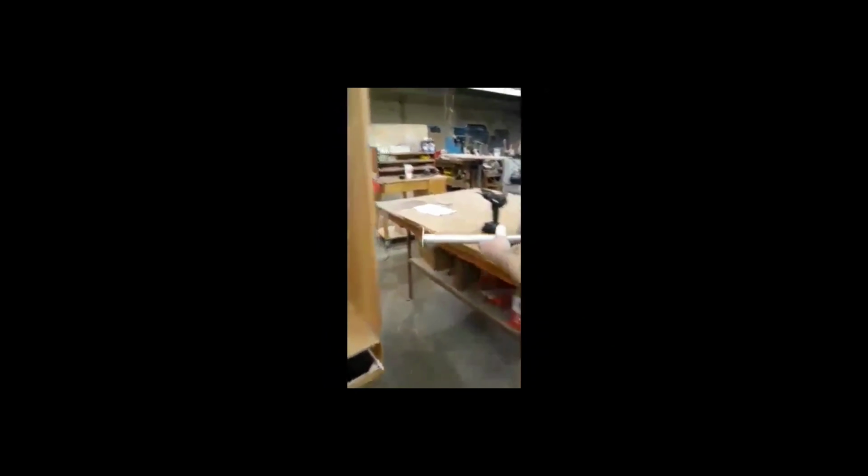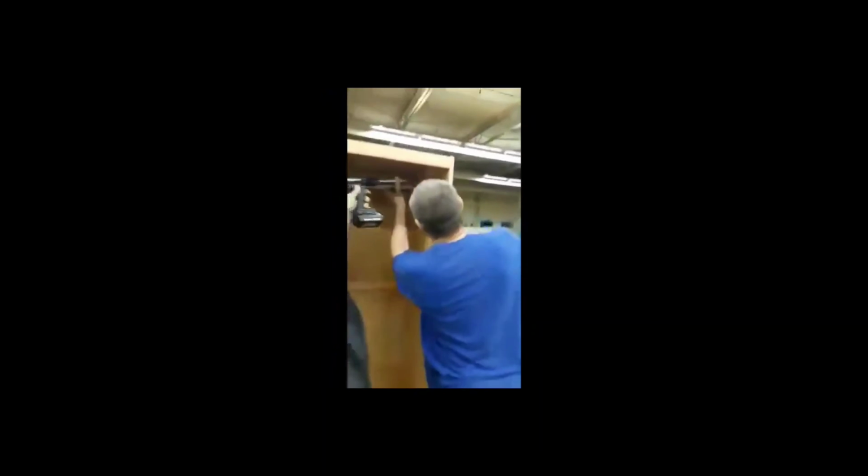Back to your drawer kit, get your adjustable closet rod. You have 3 holes milled into each side. The closet rod also has 3 holes. You're going to use these 92910 as a Euro screw. It's a number 2 Phillips head as well. All you do is line the 3 holes up and put them in.